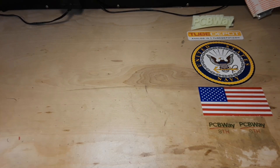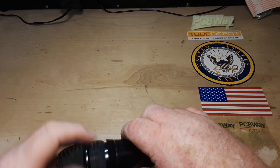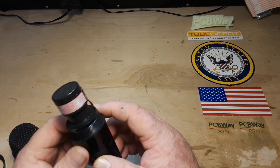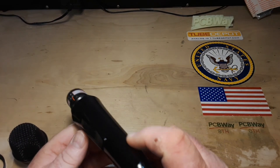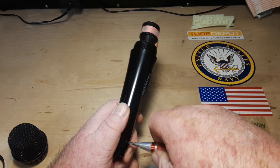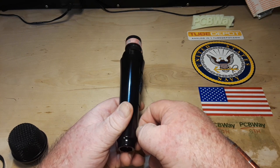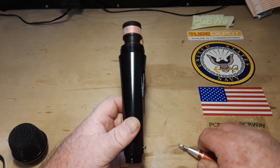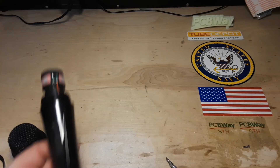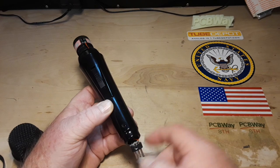So that's the inside of a condenser mic. Anyway, let's have a look inside a dynamic microphone. We have the coil. There shouldn't be anything except the coil goes to the switch, which breaks either the positive or the ground, and that goes out to the XLR connector on the bottom. There's no circuit board in here — output wires go to there, one of them is broke, and they simply come out the bottom.